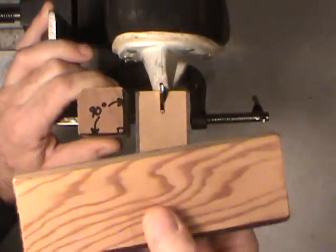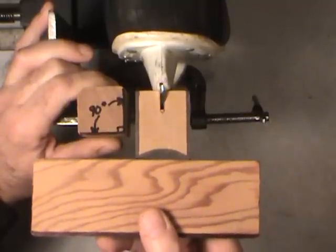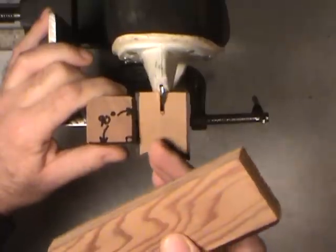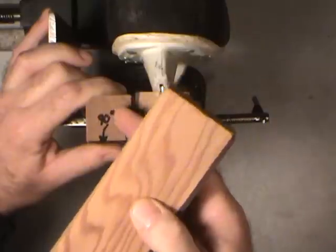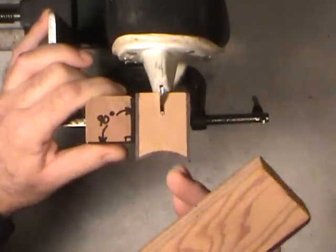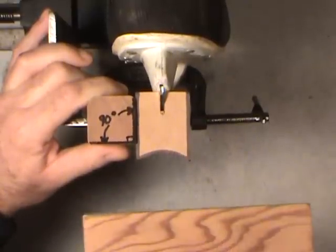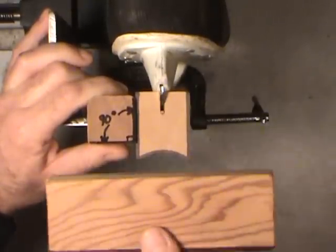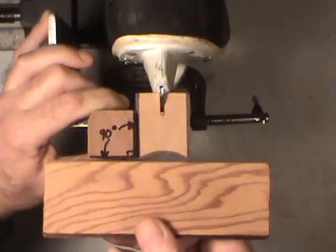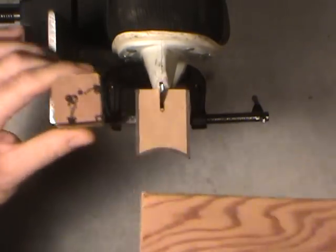Like I say, this would be the steel scale. I'd put it up against the two high points of the blade on the edges there. And then I bring this up. This is representing the blade here. This little piece of square is representing the piece of key stock or key steel that I was just showing you. Put it up so it's touching the blade all the way along. And then put this on to the two high points and then slide this up and look at the light that's in there. If you see light this way or this way, then you know you've got a high or low edge.